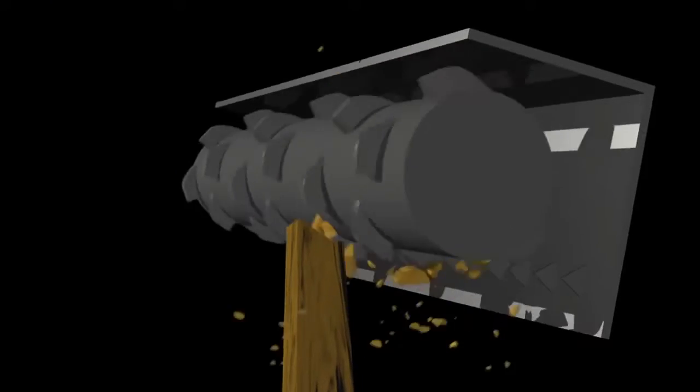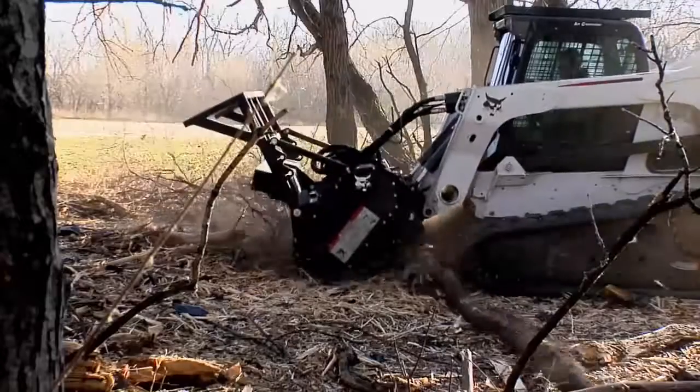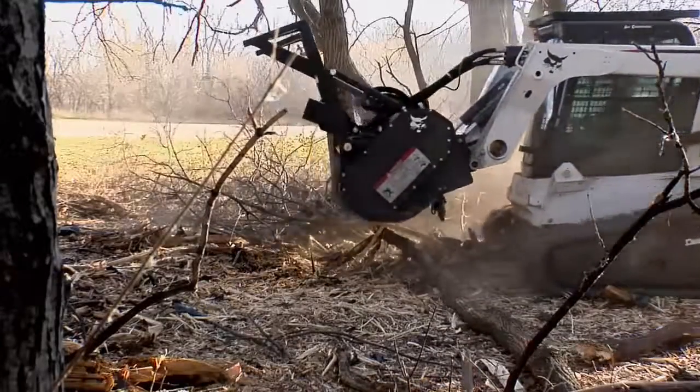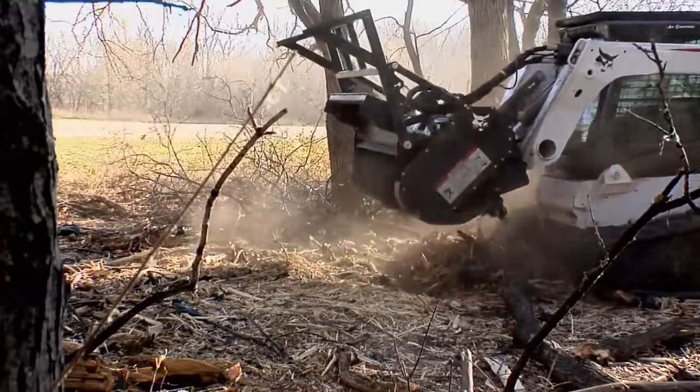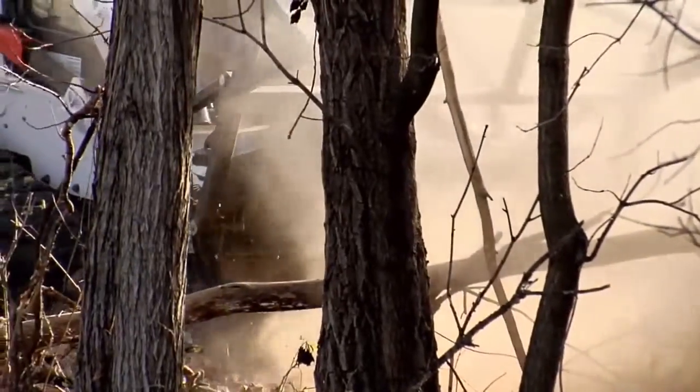As the rotor cuts up into the rear of the bulkhead, the counter-cutting rake tines work with the cutting tools to reduce and shred material. They're thick and aggressive, and you can add an optional debris door to contain material within the cutting area.